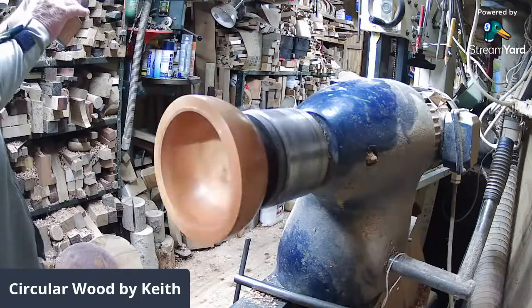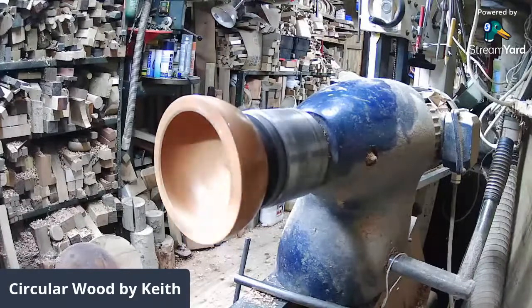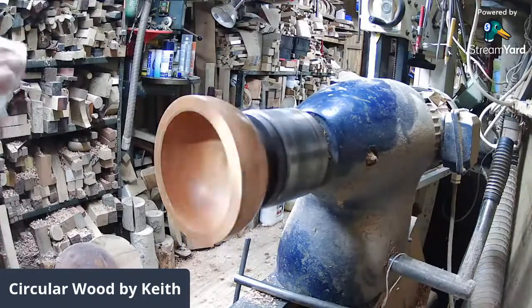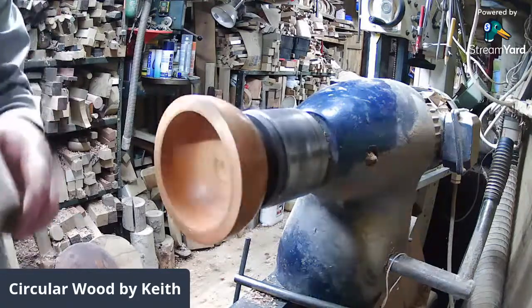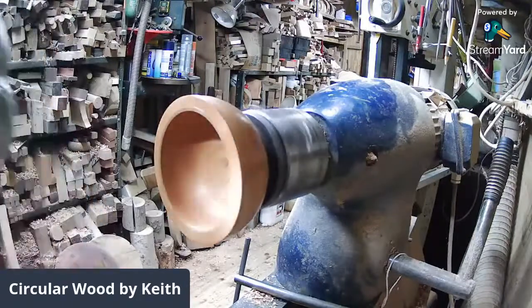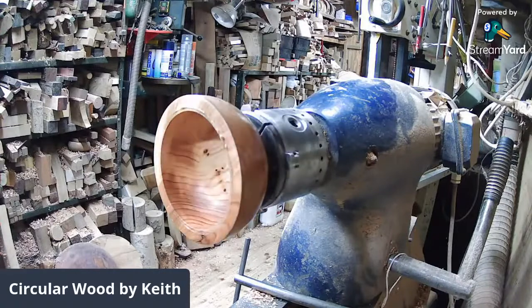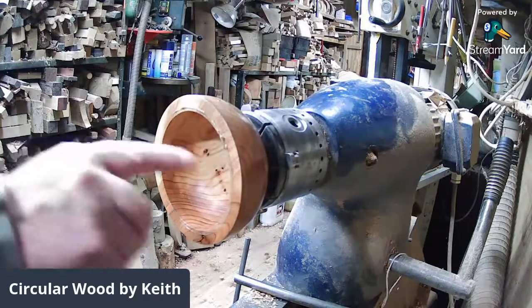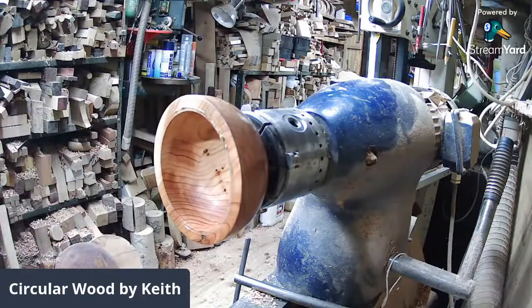God, they make that small. Oh yeah, it does say best left on for 20 minutes. So I shan't be buffing that off for the time being because you don't get the finish on it. But through putting it on with a Scotch pad, like I did then, I find that you can then increase the finish inside there to the equivalent of 1600, if not finer, by wet sanding it.